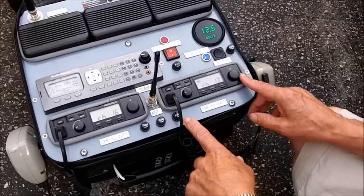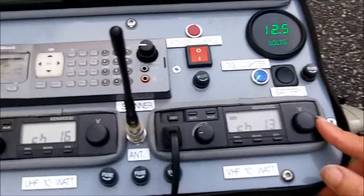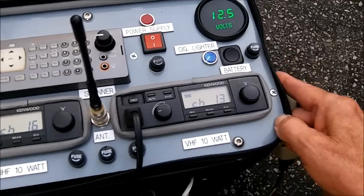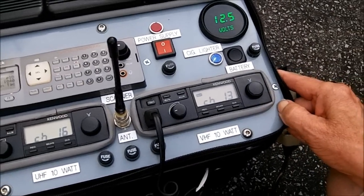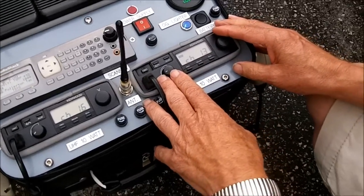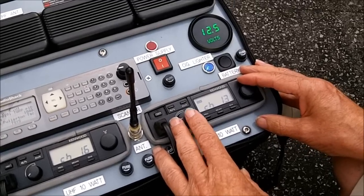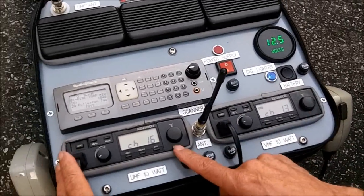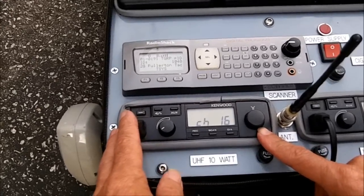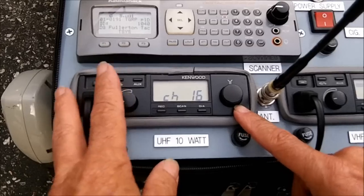This radio on the right side is a Kenwood 705D. It was a 30-watt mobile radio that I had tuned down to 10 watts for battery consumption and RF so that you don't have a problem with that. It's programmable through the face for any amateur radio frequency on two meter or the commercial band. This one basically looks like the same radio but it's UHF — it's an 805D, and it'll go from the 440 band up to 483.